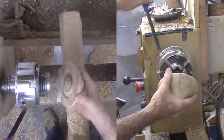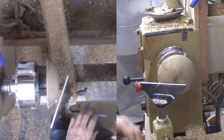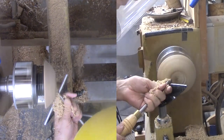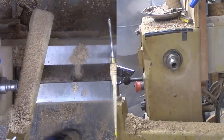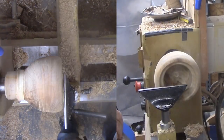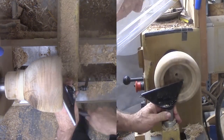Let's do some work on the lid. The lid is mounted to my chuck in that recessed tenon I cut early on. I am removing the excess wood from the lid left from when it was parted off. The last thing to do is to form a small tenon that I can use later to hold in my chuck. The bowl portion is back on the lathe. With a box scraper, I clean up a recess for the lid to seat into, then continue on to hollow out the center. The box scraper works best when it can cut an edge. So after marking a target depth on a 3/8-inch drill, I will drill the very center, then back to the box scraper. This is good enough for a rough hollow — I will be back later after the wood dries.